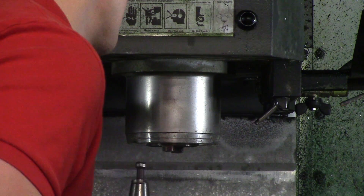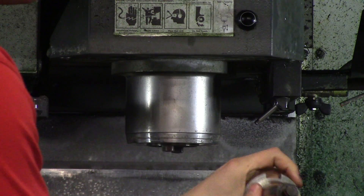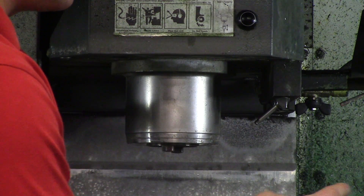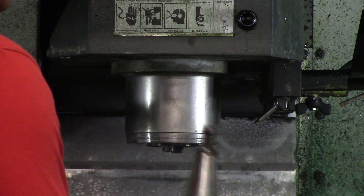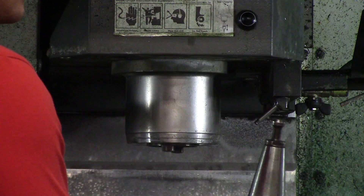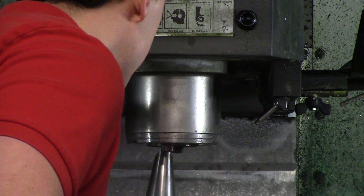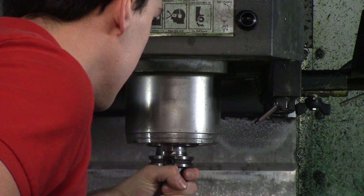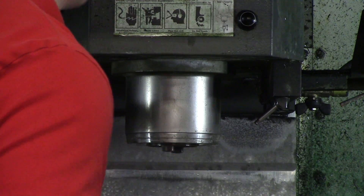How I like to do it is I'll hold down the button and I'll start with my keyways — on every tool there'll be two keyways that line up on your spindle. I like to start with them offset and then I'll rotate them into position, because you'll feel it kind of jump up a little bit. I'll start off of the position and then rotate until it goes into the keyways, and then I'll release the tool release button.